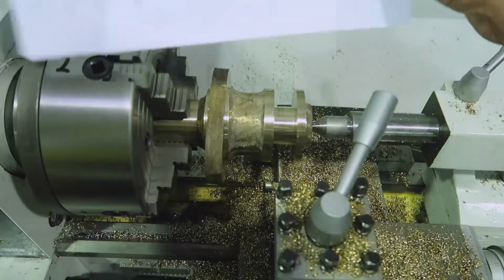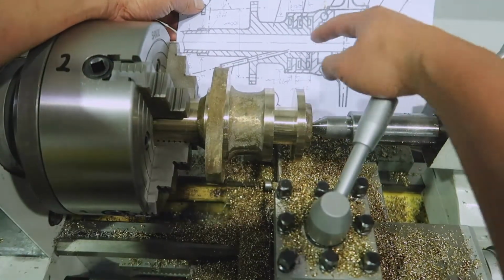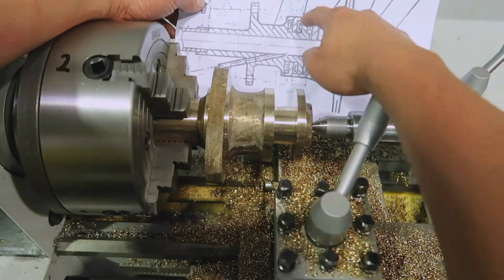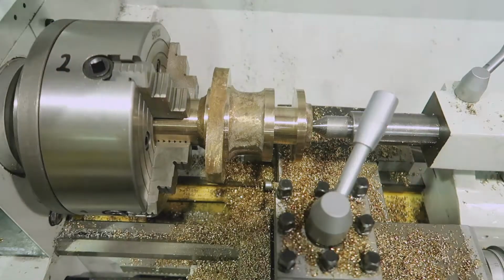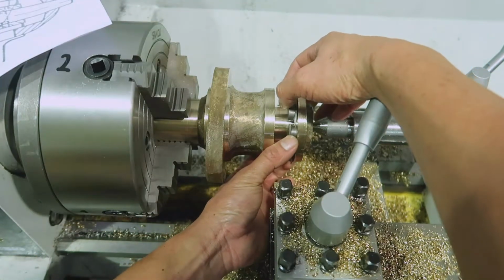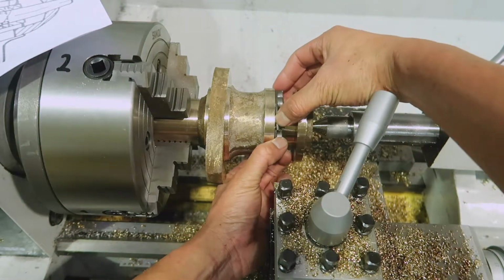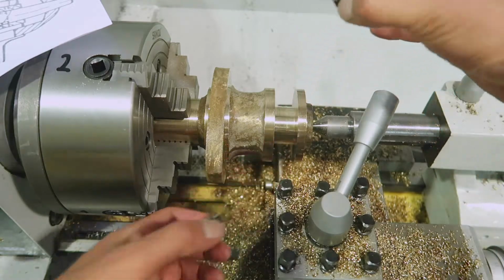Just to clarify that a little bit more, so you have this like that, and what I've done is machine this shaft down to 40, right, and that accepts the thrust bearings, which are 40. Let me show you that. Here's the thrust bearing broken in half, and that accepts that thrust bearing. Yep, cool. So that's your thrust bearings. It's a weird design. So that accepts that.